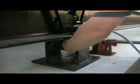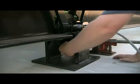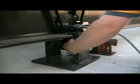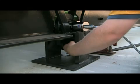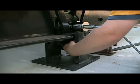Make sure it is all lined up properly and slowly release the jack. Be mindful of your fingers. It is very important that no part of this setup touches the scale except for the top of the pin. If anything is rubbing at any other point, your scale may not weigh properly.